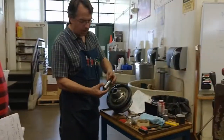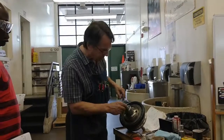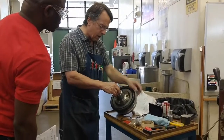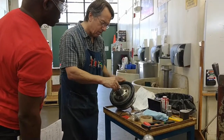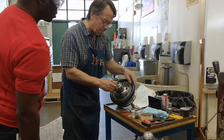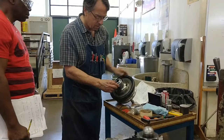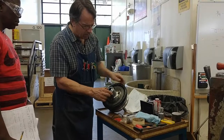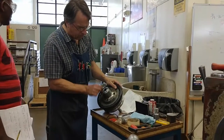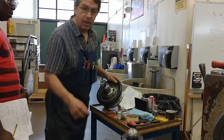You install the collet in the collet holder by aligning the keyway with the key button inside here. And you put the ring on, turning the ring so that it pulls the collet back into the holder. Okay? Can you see it going in? It's a cool planetary gear setup. There's a tiny gear here and three little spider gears here, turning a ring with a thread on it.